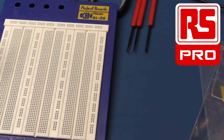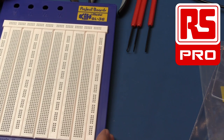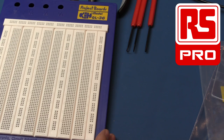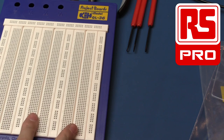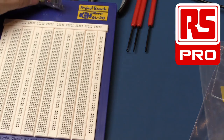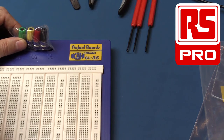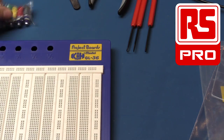These are the prototyping boards — the K&H brand GL-36. You've got about 62 or 63 positions down, three rows for components with power and ground rails for each. These ones are not marked with the little lines on them that I typically see on many prototyping boards, but that's fine — you can easily put it on with a marker. You've got a top bus strip and a set of colored terminals that screw into the top, so you can use banana plugs from your bench power supply.